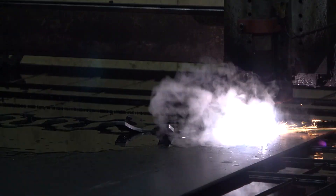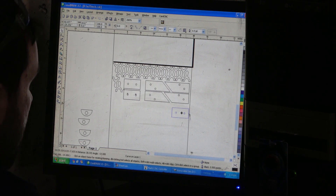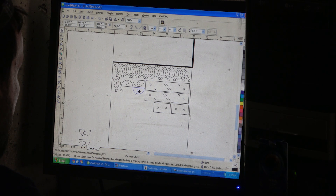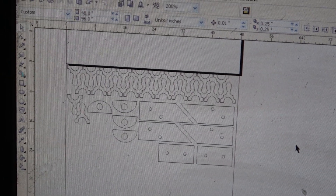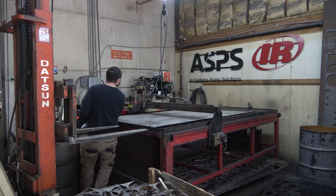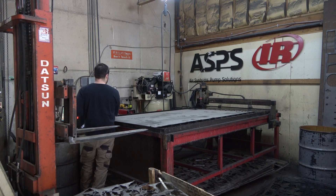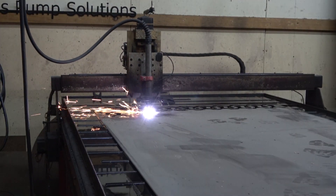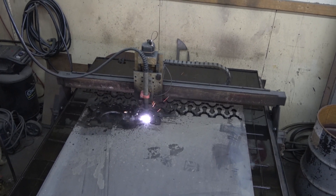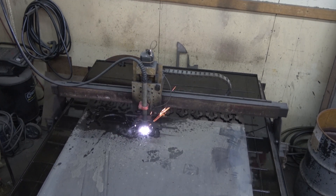What I did was save the file that we used to cut those parts exactly as it was cut into the sheet. We're going to bring that back up on the computer, reposition the new parts we need to cut for this job around the old ones. And most critically, square the table back off of a known point on that sheet — in this case, the upper left corner. That will let us place our new parts right up next to the old ones, not wasting any material. If this was a part that was not rectangular, it really shines, because you can tuck parts into the crevices of other parts and save a lot on your material.